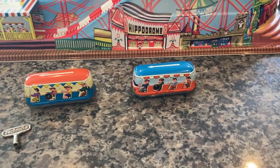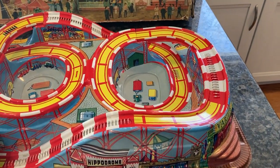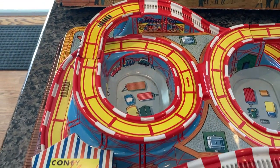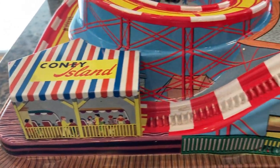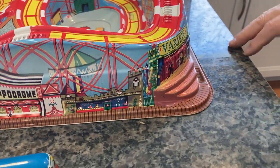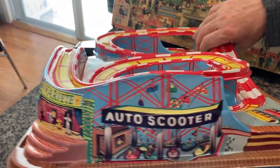Let's look at the track briefly. It's made out of what we'd call today injection molded plastic, but it's really not. Back in the 60s and 70s, what they did was print a flat sheet of plastic and then use a male and female die, stamped under pressure and heat. A lot of times you get sections where the printed copy was elongated due to manufacturing, but this one is a really good example — you can see no cracks in the corners, no stress cracks, no pressure cracks at all.